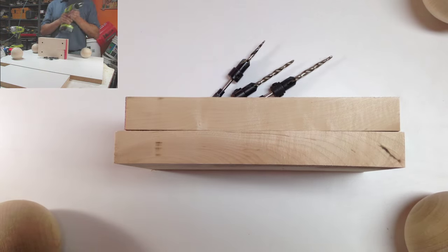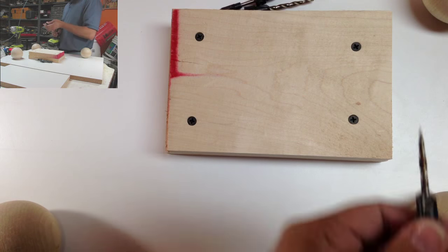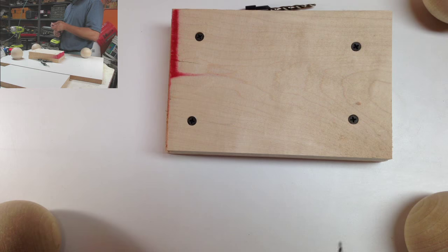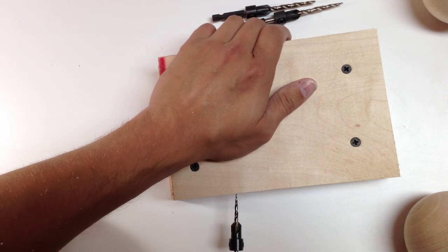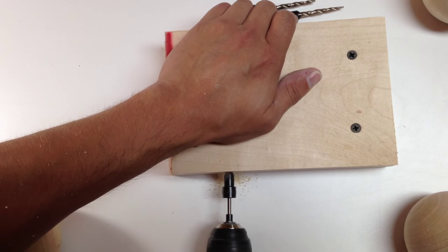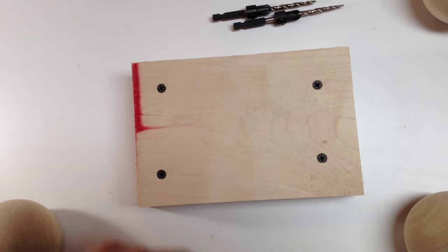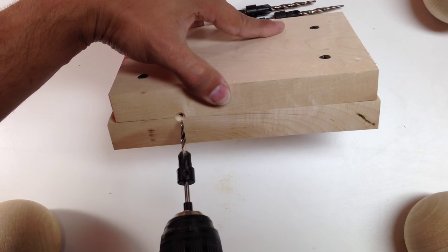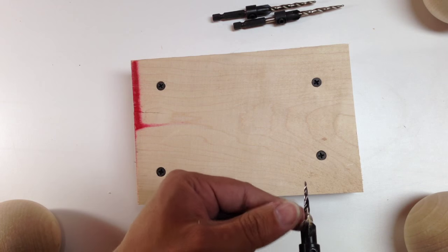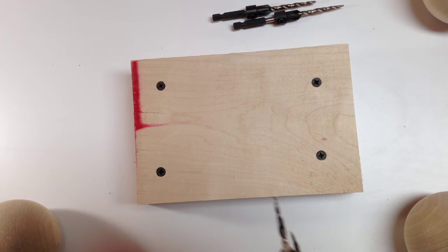So this is hard white maple — we're going to test the drill bit on that. This is an old, worn-out drill bit, and this is a brand-new one here. With any drill bit you want to make sure the material comes out on the sides. With the tapered drill bit it tends to stay inside a little more, so you might want to drill in two steps.